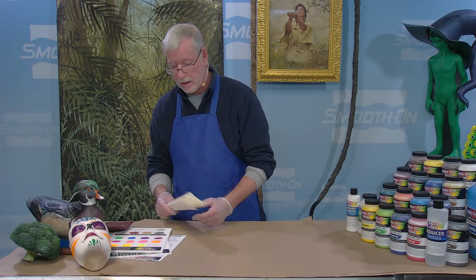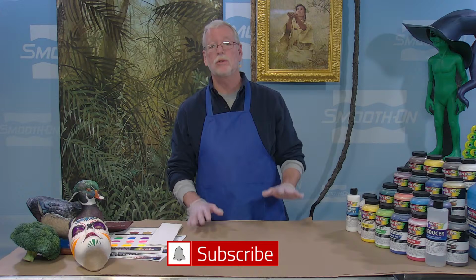Also, if you're using a silicone mold, I just want to mention release agents. If you're painting and having problems, and you cast into a mold and used a release agent, that's a problem. So if you don't have to use a release agent, say in a silicone mold a lot of times, don't use it. If you do, you can use isopropyl alcohol and wipe that off, some soap and water. Make sure it's completely dry.